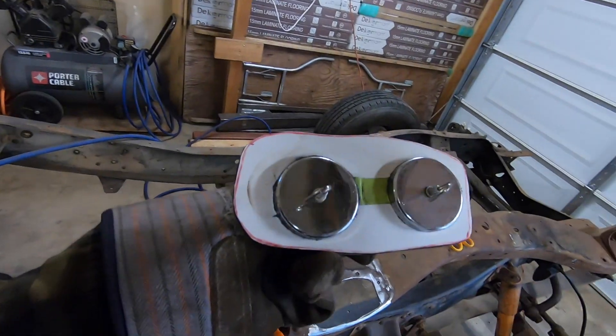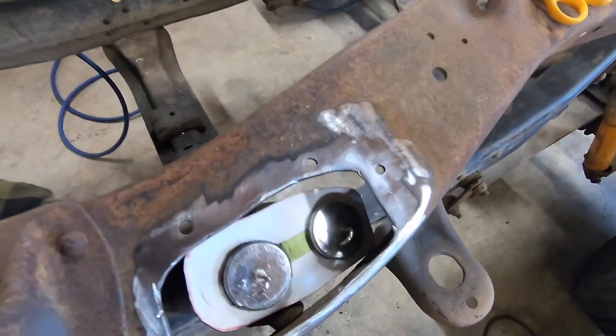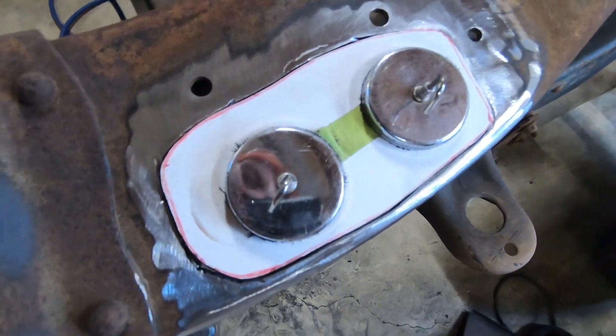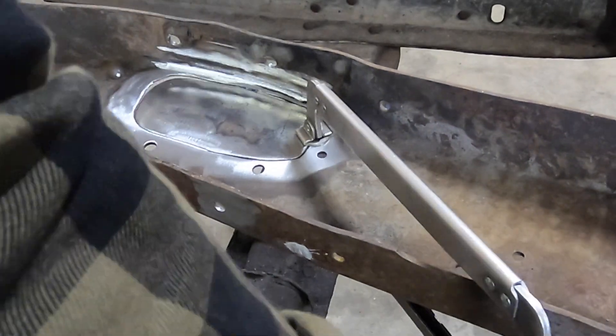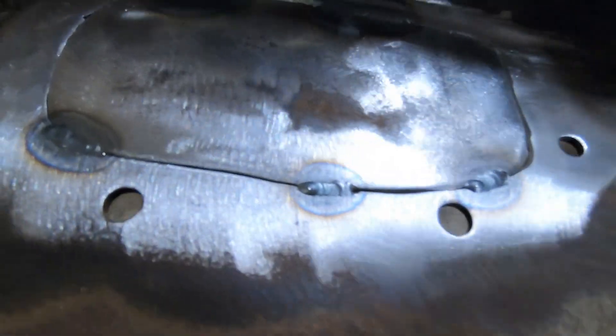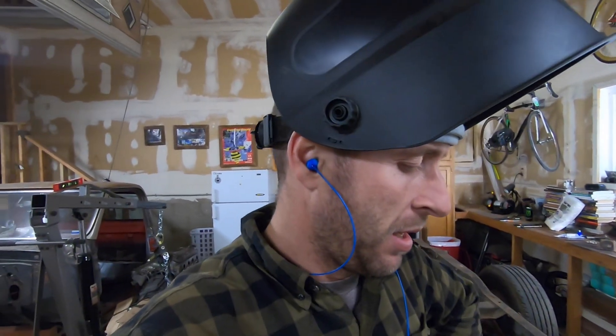I used magnets to hold my template to the piece so I could grind all the edges. The magnets make it hard, but it fits right in there — nice tight fit. TIG weld them — you want it really tight. I just stitched it in there a little bit, but you can see some little TIG stitch welds in there. Now I want to fully weld it in. I want this side to look nice — I don't plan on grinding the welds down on this side, I'm just going to leave them. Unless they're horrible — then I'll grind them down and tell you guys that they're pretty.